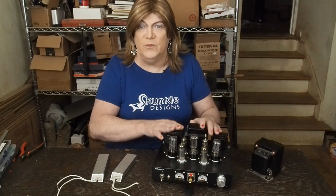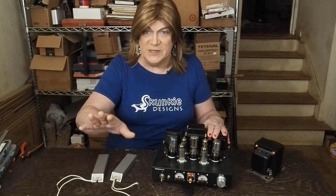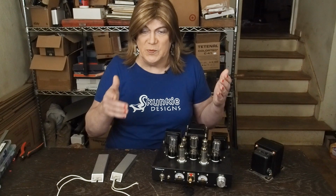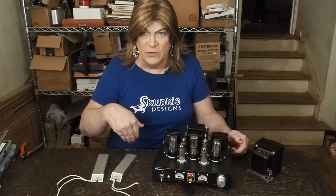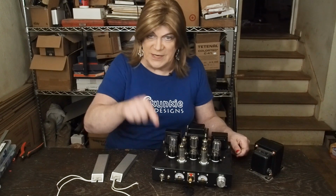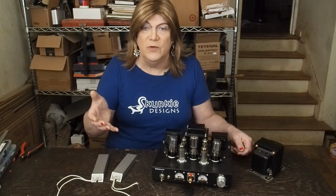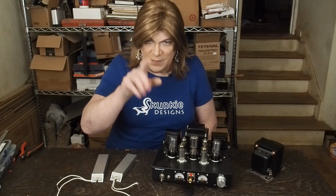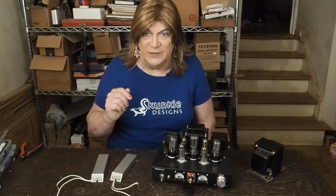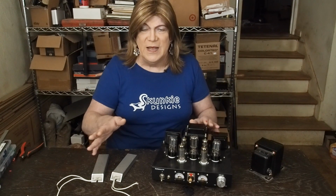Not only does it help keep you from shorting out and frying your expensive oscilloscope, it also helps protect you from shock by not having a ground potential through your body. I'm not saying you can just stick your finger in here and poke around and not get shocked. You're still going to get shocked. But it helps keep you from possibly getting shocked if you touch a positive with one finger with no path to ground. So it helps keep you safer, and it keeps your equipment safer.